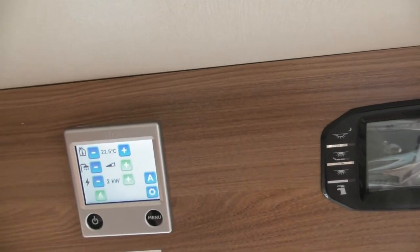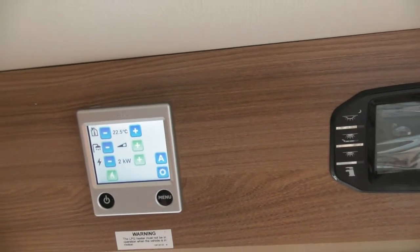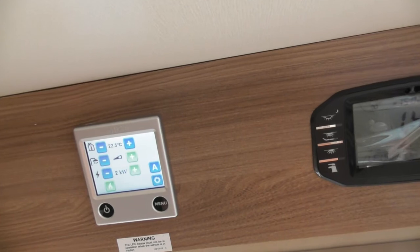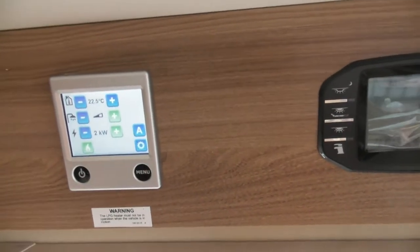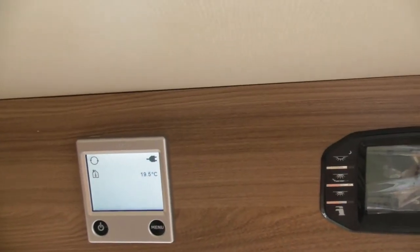If you use electric and gas, going away in the winter time when it's really cold, it definitely will give you more energy, more heat. What it will do is use both energies from cold, get up to temperature, and then it'll shut the gas off, and it'll tick over on electric until someone like myself leaves the door wide open, the temperature drops, and the gas will kick back in again alongside the electric, bringing it back up to temperature. That's the heating. The same applies if you've used all the hot water. If you use all the hot water, it's obviously topped up with cold water.